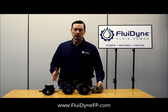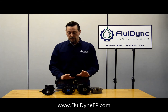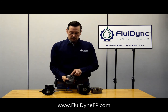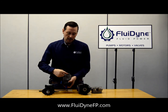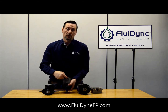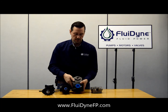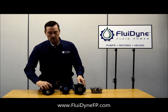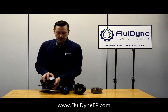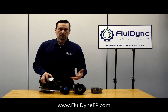One more thing to go over is the orifice size for your flow rate out your cover. On these three pumps, it's going to be inside the pressure port on the cover. Here's your pressure port and if you're able to look down inside, angled off this way, there is an orifice which is going to be your controlled flow out your cover. It's the same thing on the V20 F-Cover, it's down in here, but on your VTM, it's right inside your outlet, very easy to see. That's where you're going to change your flow rate if you need to vary it from three gallons to five gallons or what have you.